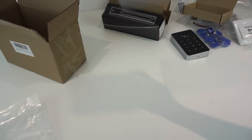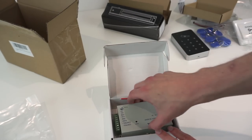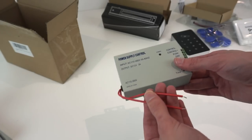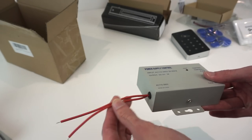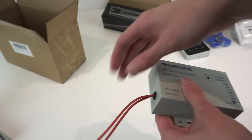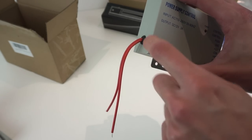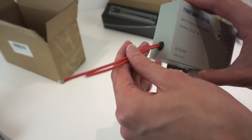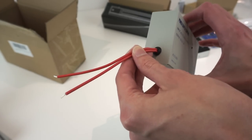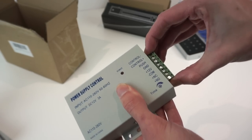Finally we've got the second part I'm actually going to be using - a little power supply kit. The idea is you put mains in here. I don't quite like this - in the UK you're not meant to have single insulated cables carrying mains unless they're inside trunking, so this isn't really compliant. I'll try and replace this with a bit of proper flex. It's also not earthed despite being a metal case, so I think I'll need to do a bit of modification to add an earth.